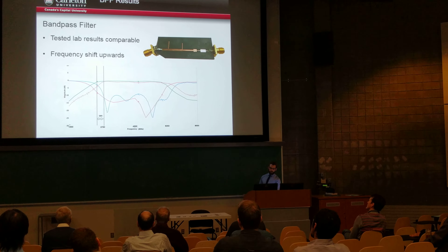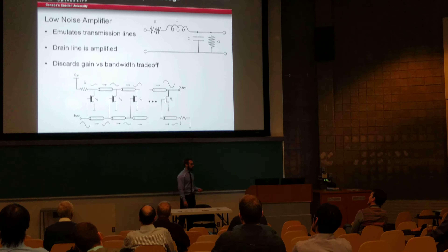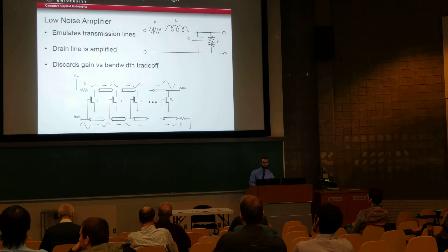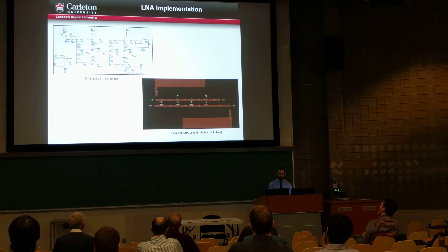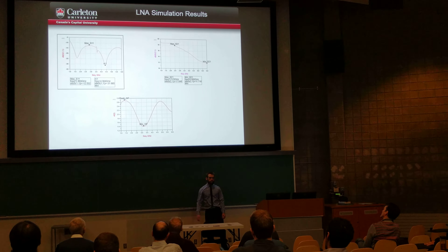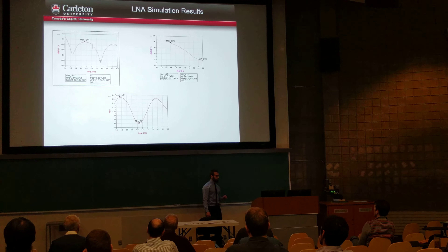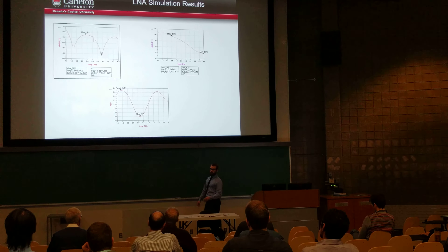After that, these are our results in detail for that. We have our low noise amplifier design. We need a very wide band amplifier, and the perfect candidate for this is the distributed amplifier. It's a clever design in that it emulates a transmission line, and you won't need to do nearly as much impedance matching — which is really tricky over such a wide band. This is our assumed layout for the LNA. We have a really good boost of the signal — about an average of 14 dB of gain. What's more important is the noise figure, because while you're boosting the signal at the first stage, you don't want to introduce a lot of noise, or else you won't be able to find the signal.